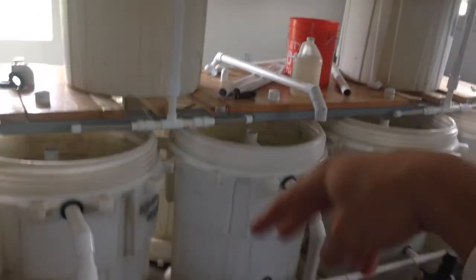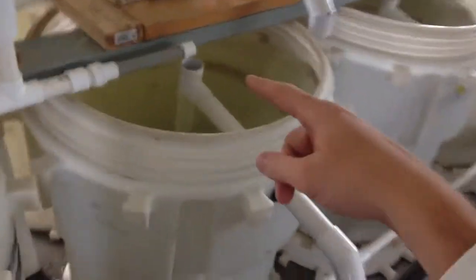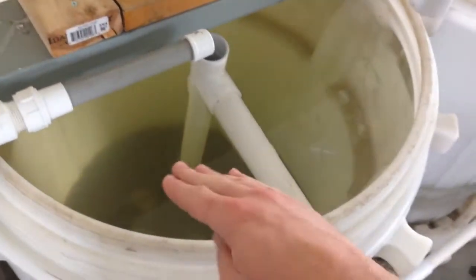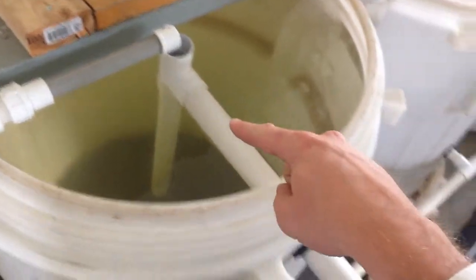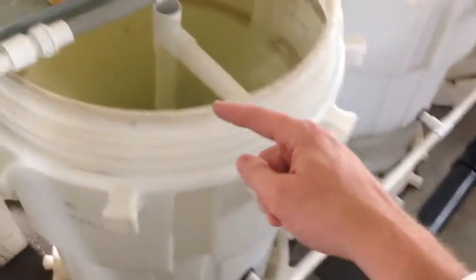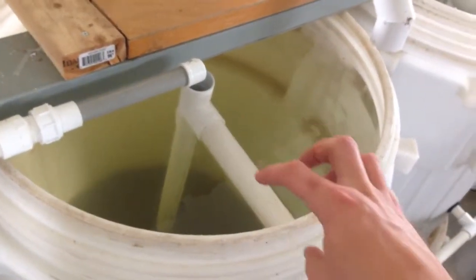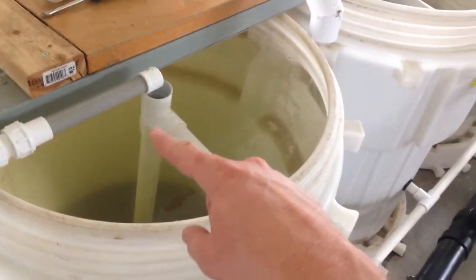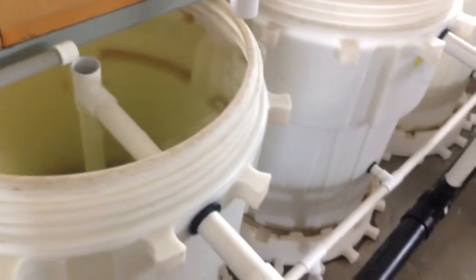You can see this line coming from the back side all the way to the sump tank. As the water fills up, the only way for the water to escape is through this standpipe here. The weight of the water pushes down, hits that standpipe, comes up, and flows out and down to the three-inch back line. The reason you have a T here instead of an elbow on this one-and-a-half-inch PVC pipe is to forestall or prevent the siphoning effect, which is really important when you're building these sort of systems.